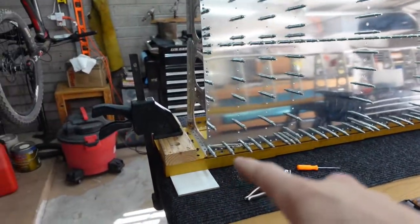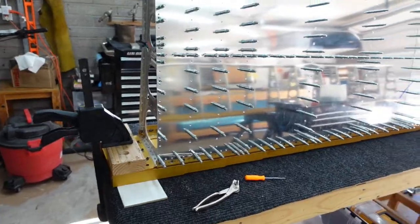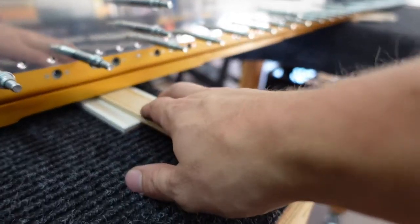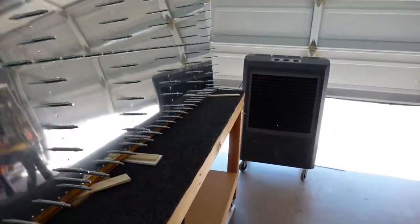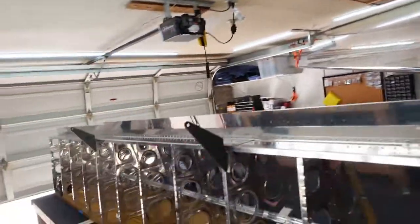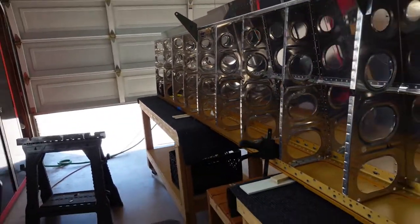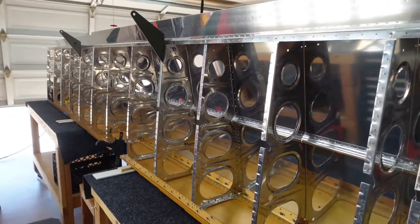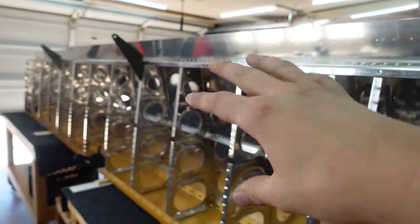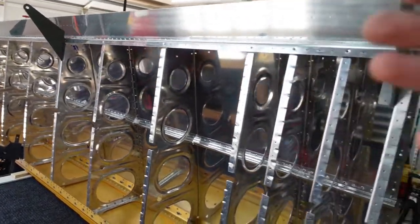You'll notice both sides of that spar on that reinforcement piece, the top side and the bottom side are different measurements all the way down. You'll see they kind of step down along the way there. So I wanted to make sure it was nice and flat the whole way down, fully supported. I know when I was troubleshooting that issue with the gap at that inboard and rearward most portion on those five holes, that was a question that they asked, like, hey, did you make sure it was supported along the way? It was. It was really nice and straight. I think it went through with the digital measuring gauge and actually made sure even left and right, in this view here, this camera, left to right, that was the same level all the way down the length of it. Not sure if it would have caused any kind of a twist or anything, but just really erred on the side of caution here.